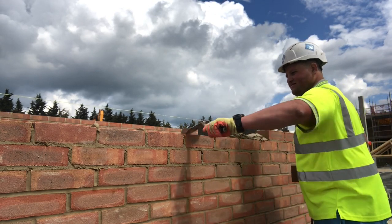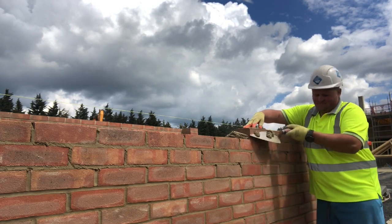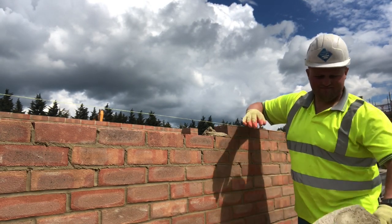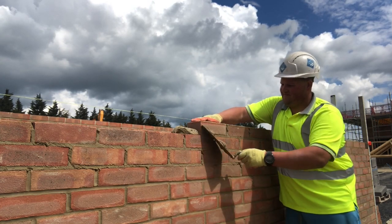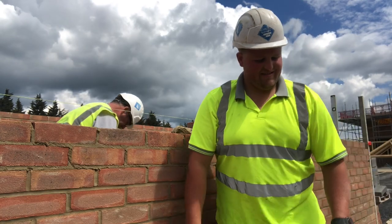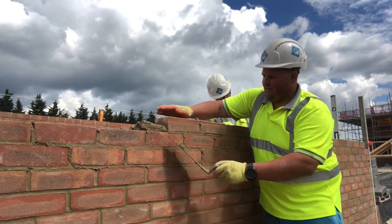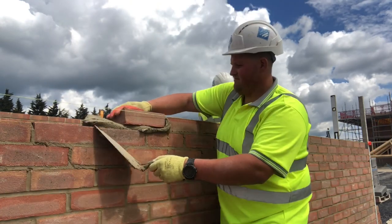When you've started running in — whether it's blockwork, brickwork, whatever you're doing — keep on top of your pointing. That's the biggest thing when you're on your own. Don't let your jointing go too dry or leave yourself too much pointing, or else you'll be pointing up for ages before you leave. In winter this isn't as much of an issue — you can crack on without pointing straight away because your bricks will be wet, and then point after you've cleaned up and covered over. In summer you need to stay on top of it. I used to leave all my pointing to the end of the day in winter when working solo — it worked great. I'd lay a good 600 to 700 bricks some days and leave a full garage gable of 20 courses' pointing all to the end.